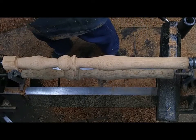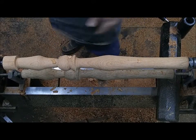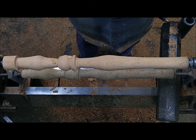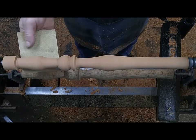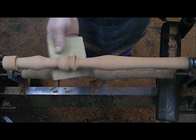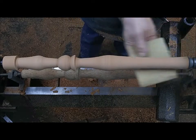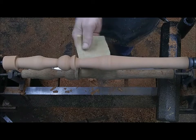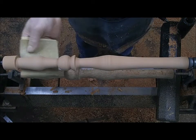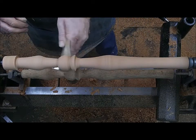Here's the product of what we started with — wood chips. That's crazy. Let me get a little 100 grit here and knock that out real quick. I'm going to leave it sped up where it is, about 2000 RPM, but I don't press very hard. I'm just doing a real light pass — I just want to get that white, rough area. There's just a little bit of roughness coming off there. My bit's a little dull, and it's probably about time to rotate that around to a fresher edge. I've been using that side quite a bit.